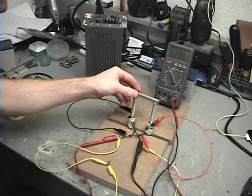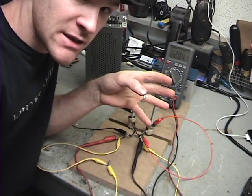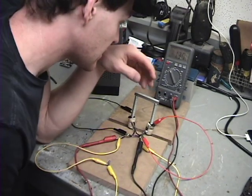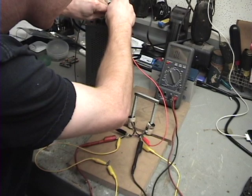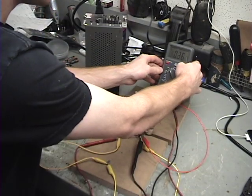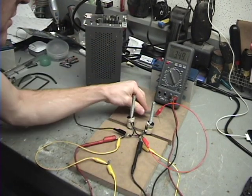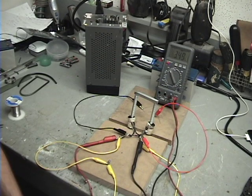So explain that to me. What's cool about this is, theoretically, I believe it would work because I left it sit for about four hours today with just a voltmeter to check voltage. I pulled this off four hours later and it still did the same thing — still the same voltage. Let's do it one more time. I'm going to set my meter so it catches the spike. We're charged up, shorten my cap out, put this meter on peak high and see what we can get out of it. Here we go — 3.49 volts. I'm sure if you look at this on an oscilloscope and see the peak, it would probably be bigger, but that's what I hit — almost three and a half volts.